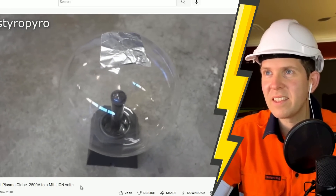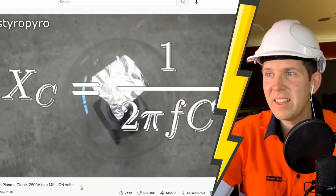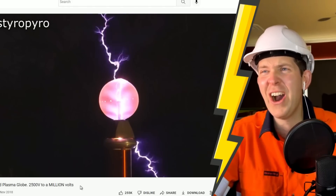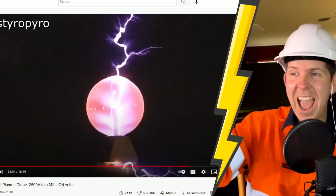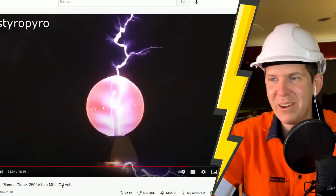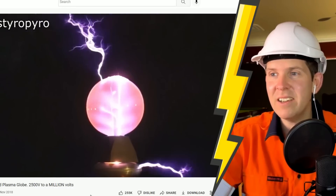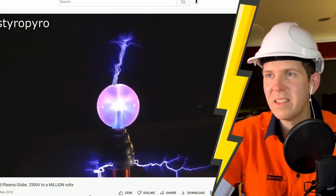That way it capacitively couples to the top of the coil. At these frequencies, whatever capacitance this arrangement has is going to have an incredibly low impedance, so the arc should just shoot straight through the globe. It's going to blow away. I can't convey how much power is coming out of this thing. Don't try and recreate anything like this at home - if you stand next to that, it is going to arc directly to your body and go back down to earth. There's that wonderful arc I was after - it shoots two feet out of the top of the globe, which I think is pretty impressive.